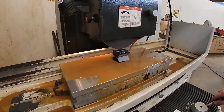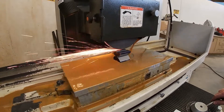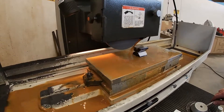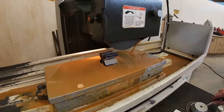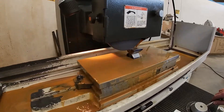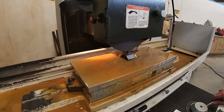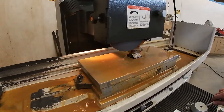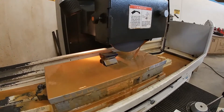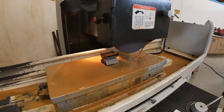This is one thousandths. I set my stop to where I'm going to remove six thousandths total. I'm almost getting a full clean on this side, which was technically the low side — which tells me by the time I get all the way across to the side closest to me, I should be getting a full clean-up all the way across the part. From my six thousandths stop, I'm going to be keeping all my features more or less perfectly centered in the v-block. Now you're making two v-blocks, so you'd have yours side by side and measured to make sure you were touching off on the taller of the two. So I'm feeding down.